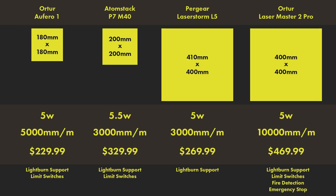At $329 MSRP, and occasionally on sale for a little under that, this falls right into the mid-range of our lineup. It has a suggested max speed of 3,000 millimeters per second, which is fairly common. This is of course going to vary based on material and dot size, so you may average somewhere under 2,200 millimeters per second to be more realistic when going for a desired mark. While this machine claims a power rating of 40 watts, that does not represent the actual laser power hitting the material, which is more realistically 5.5 watts in this case. This is more or less what we're seeing across the board, however as we'll talk about, this isn't telling of the whole story.